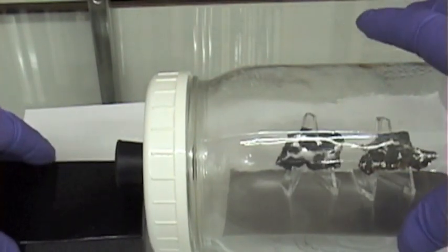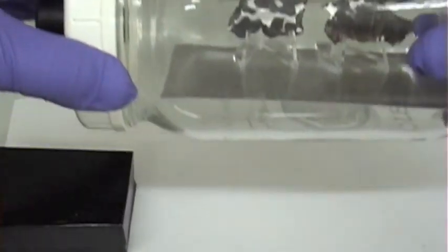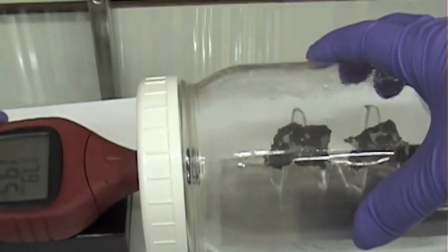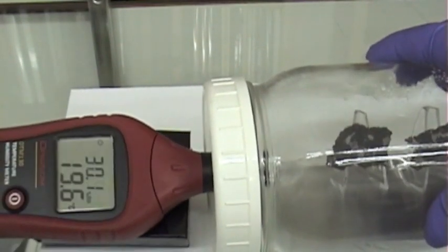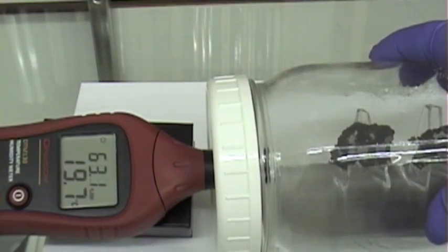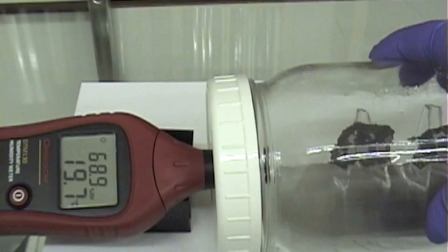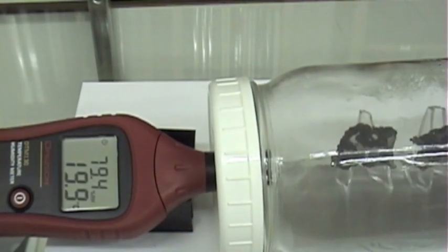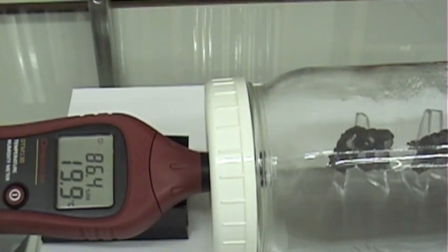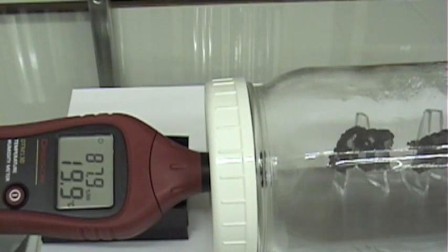In the other jar, we had water in there, so we should be at pretty close to 100% RH. It's been sitting in that for a couple of weeks, simulating an environment like Louisiana, Houston, or a beach house — somewhere with pretty high humidity. I kept these specimens uncoated just to speed up the effect. If you put a coating on there it'll slow it down, but no coatings are perfect — they allow oxygen and water to permeate.